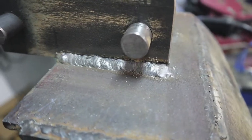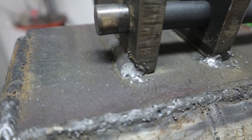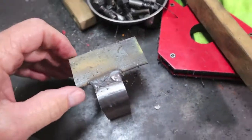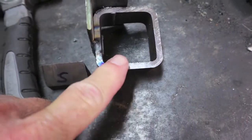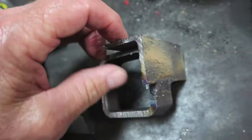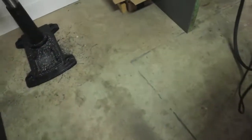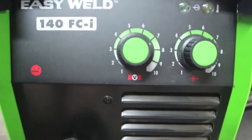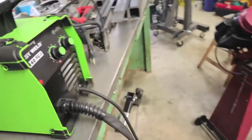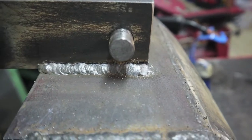Really liking the welder — that's one pass here, and I think and hope I'm getting enough burn-in on it. I'm going to weld what I can on the inside also. This was like a test piece — three-sixteenths wall with an eighth-inch thick piece of angle just slapped on there. After I set it up for this I increased the heat up a little bit, though I'm nowhere near max. I just don't want to go any hotter. I welded the full three-inch length and right at the end it popped my 20-amp breaker.